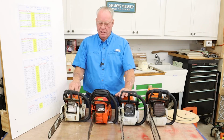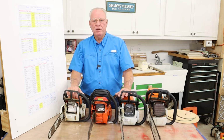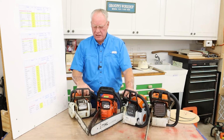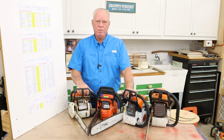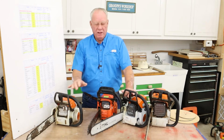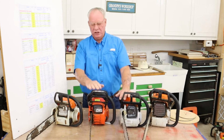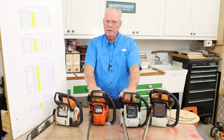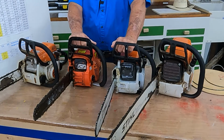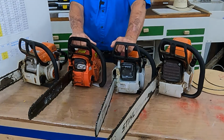So you look at a bunch of chainsaws on a shelf, pull the bars together. Look at the size of chain on it. Those little small chains are telling you it ain't got enough horsepower to pull a big chain. So that's a good indication of the power of a saw. And manufacturers have taken care of that for you, but they just don't want to put it out there. The claim that a 16-inch saw will cut a 32-inch tree, that's a ridiculous claim. And don't fall for that kind of misadvertising from any of these people.